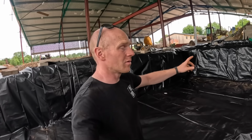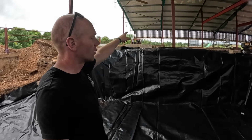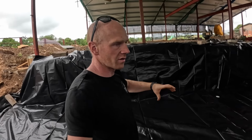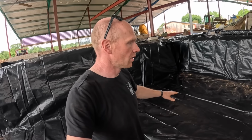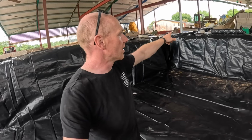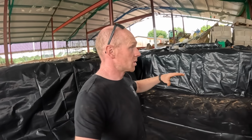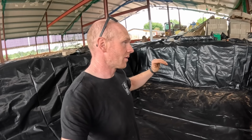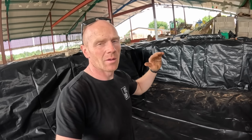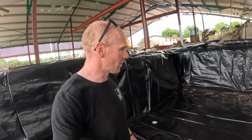That was a success. So we've got all the panels around now, the mesh panels. There's two up there. One of those needs to go in first, it's a bit bent. So we're gonna get the bottom ones on 40 mil chairs. Once they're down, we can then wire in our spacers. They're like continuous wire chairs, which are 150 mil tall. And then we should end up with the second layer of rebar 40 mil below the top, because that's the spec that we've been given.